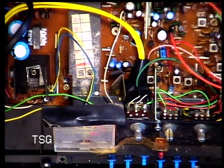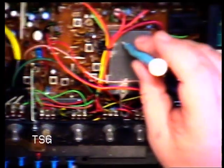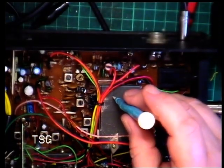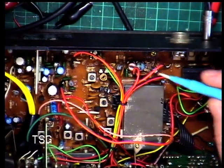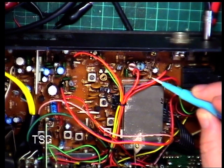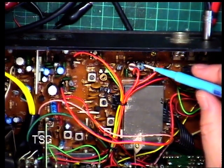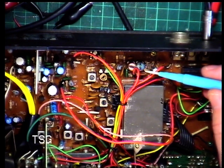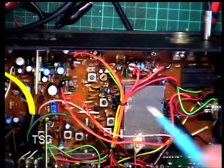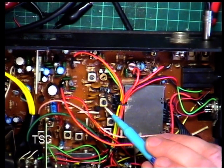would be to change the oscillator crystal there in the VCO can, and if we knew we could get spare parts, if we had a scrap chassis, there is of course that blue core could be changed, but I'm sure it's in its optimum position and we won't be getting this performance. Conversely, that one's been mashed about by the diamond encrusted golden screwdriver, and that could do with being changed.